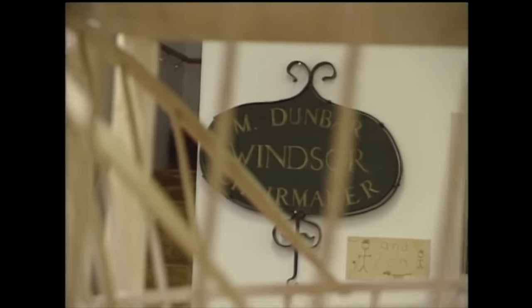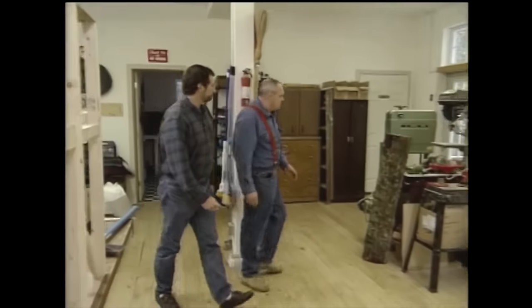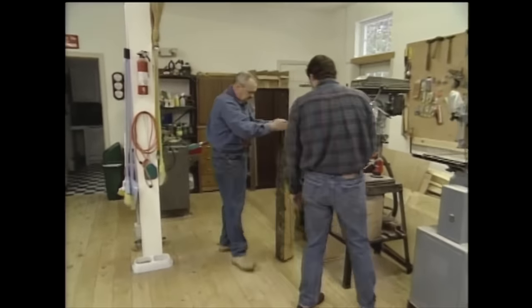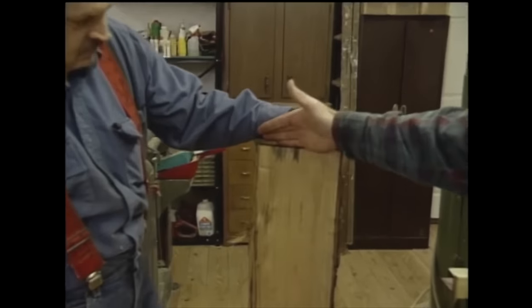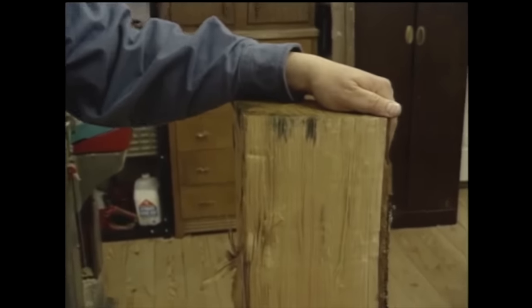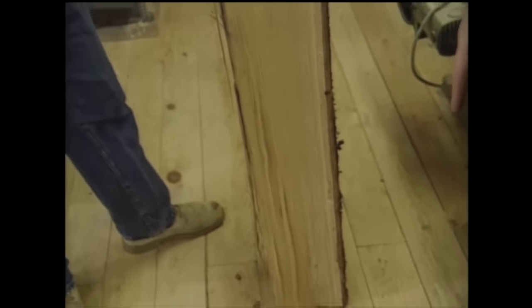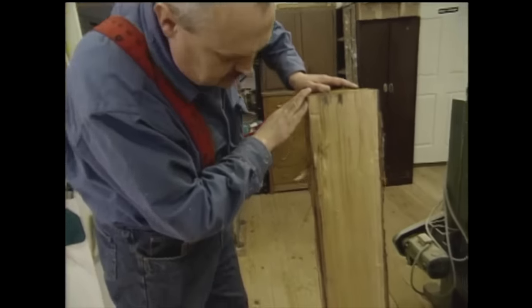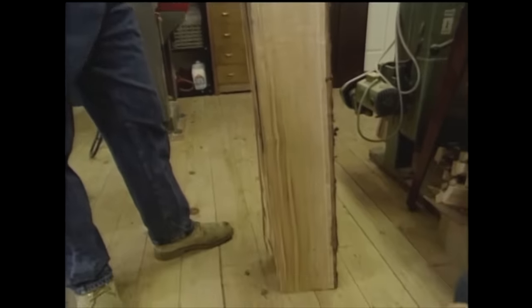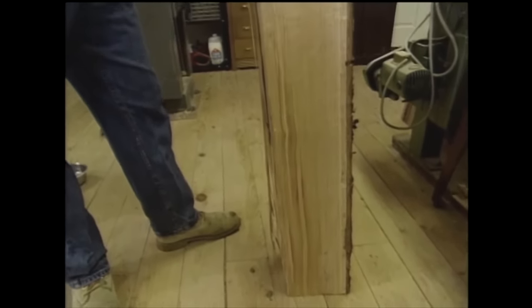Any favorite species of wood for bending and steaming? The wood I prefer to bend and steam is red oak. Here's a piece right here — just a quarter of a log. This was harvested about 60 days ago. If you're going to work with green wood like this, it's best to get it in the fall because the sap is down. This is a pretty nice looking piece of oak — the grain is almost perfectly straight the whole length of the piece, and that's what we selected it for.